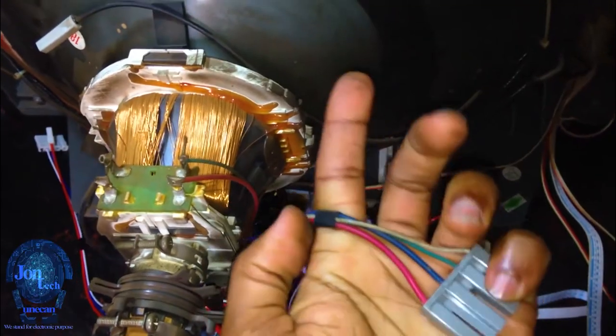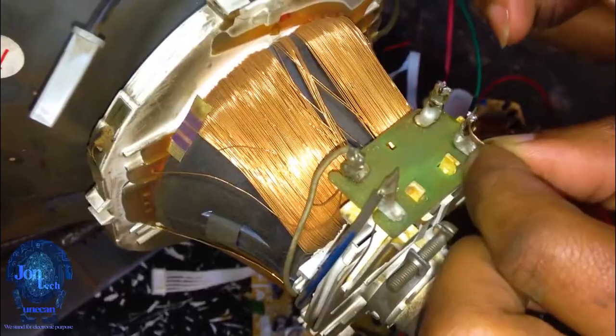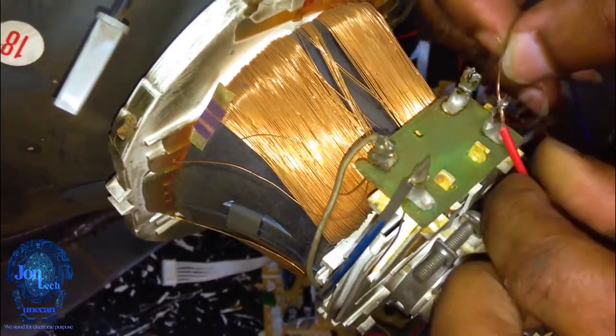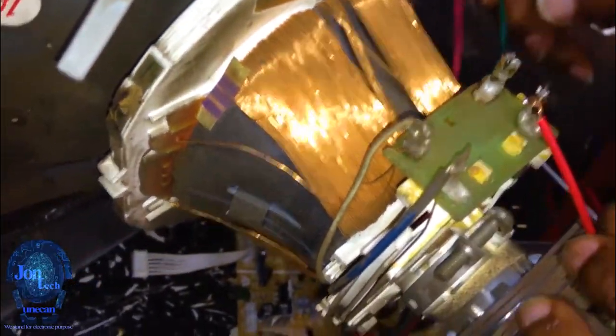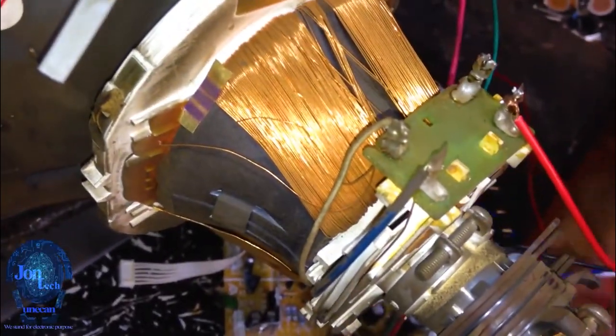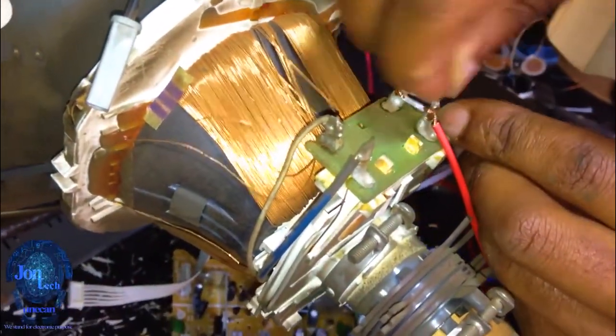Secondly, I started soldering the deflection yoke connector, respecting the vertical and the horizontal coil connection. If you find it a bit complicated, try following the same color codes and make sure to ground the high tension coil before any servicing. Failing to do so may lead to death or other kinds of serious injuries.